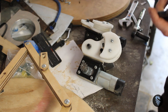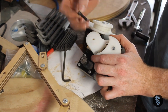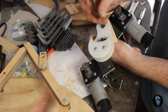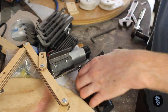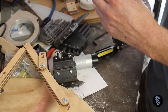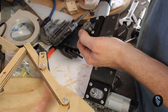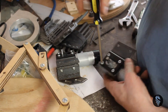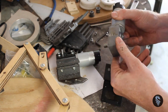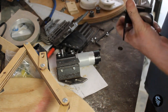Now we're getting into tearing down my old motor brackets. These were overly complicated and had a lot of degrees of movement, so I'm just going to be doing away with everything. It's a little bit of a pity because those chain guides are quarter-inch HDPE plastic that I designed specifically for this application and they actually worked pretty well. But as you can see, there's a lot of room for adjustment, which means there's more slop in the system. I would get a bad chain snag and it would actually force these brackets to shift — then I'd have to stop and recalibrate everything because my motor spacing changed. So it made it way more tedious.